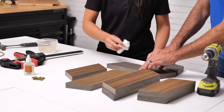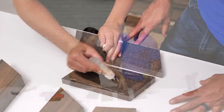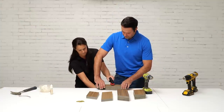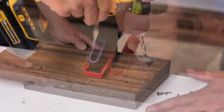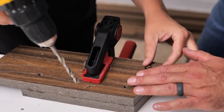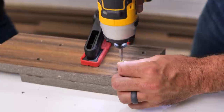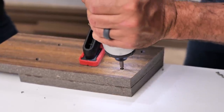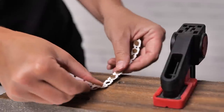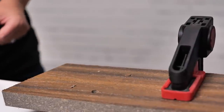So we need to screw these together. First we will dampen this and then glue. Clamp on that — if you'll line that up I'll clamp. We're always going to pre-drill and then also drill an additional larger hole for the head of the screw so that it doesn't mushroom up the finish on the top of this board. We're using screws that are specially meant for composite wood. We can't fill it with wood filler so we're going to be using these specialty plugs which match our finish, and we'll be tapping these in to cover the screw holes so they're not so obvious.